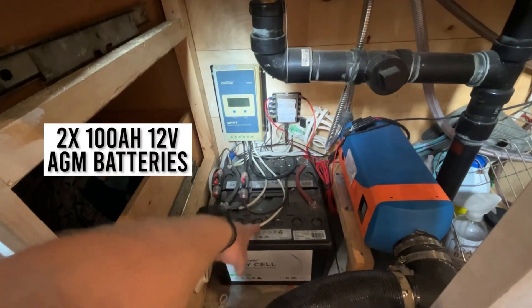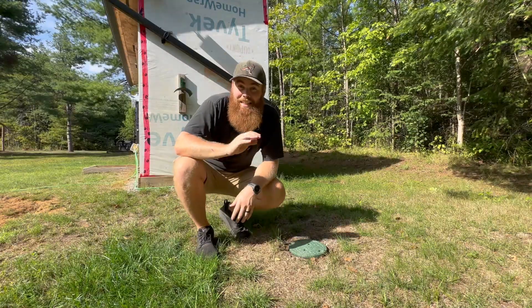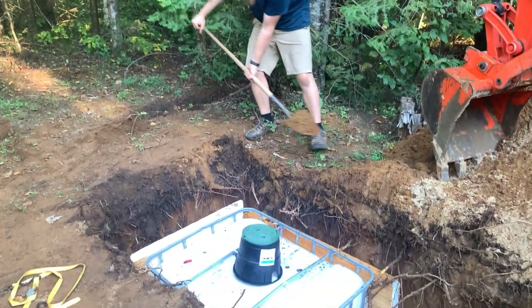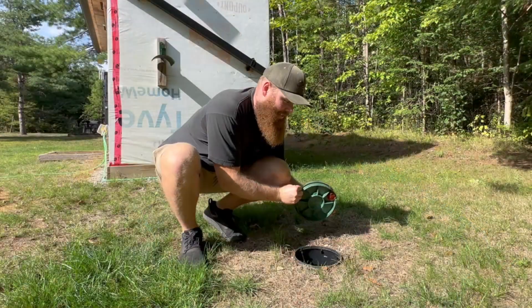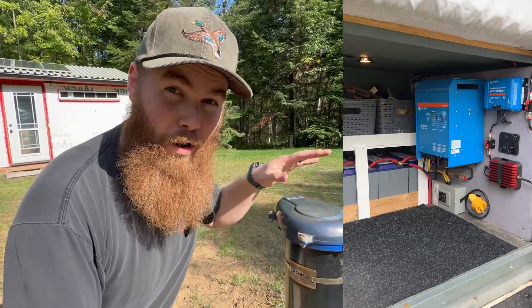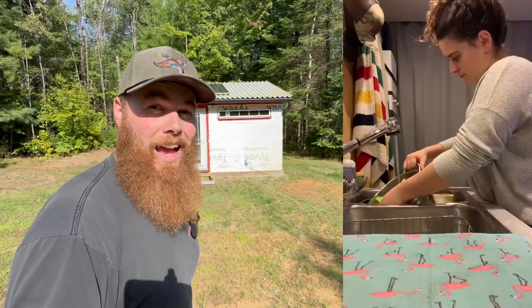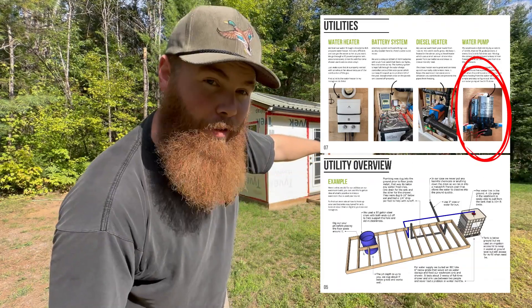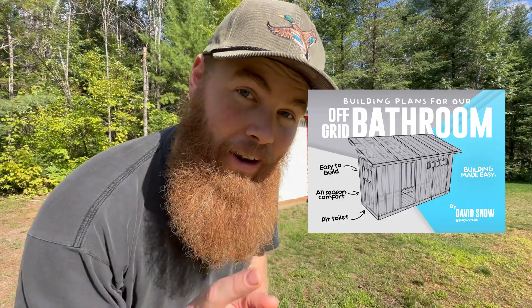To use the well for our off-grid washroom, I had to come up with a solution. The off-grid washroom had a very simple DC battery setup, so it couldn't run the 120 volt AC power for the well. So this is what I did: we built a DIY cistern into the ground. There's a thousand liters beneath us right now. We took a thousand liter tote, dug a hole, placed it into the ground, insulated it on all sides, and gave it an access cap to fill up the water. That saves so much power — I only have to use the inverter in the van for about 20 minutes to pump water from the well to the thousand liter tote. That tote will last over two and a half weeks for showering, washing dishes, and whatever else you need. And water access in there is year-round because it's heated. We use a 12 volt pump to move water from the cistern into the off-grid washroom. If you want to see more, check out the full off-grid washroom video — and if you want to build your own, I have plans in the description.